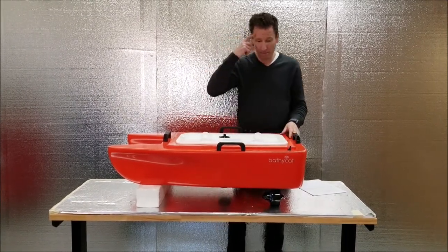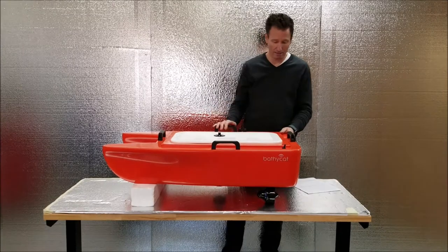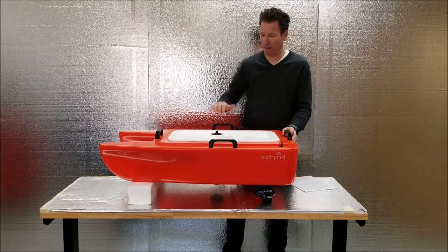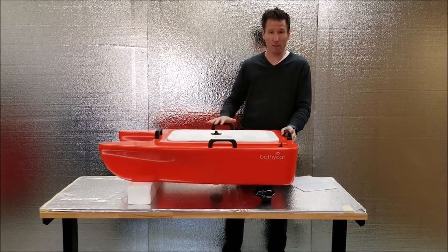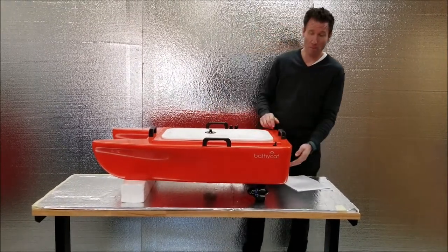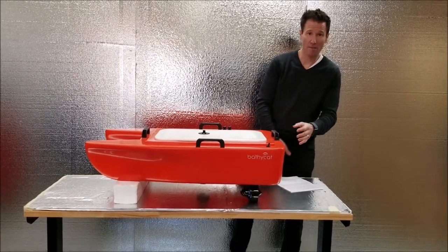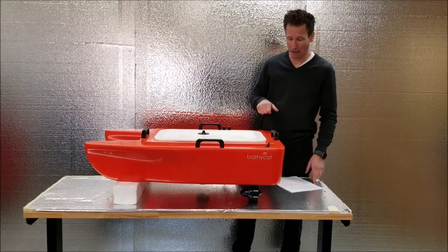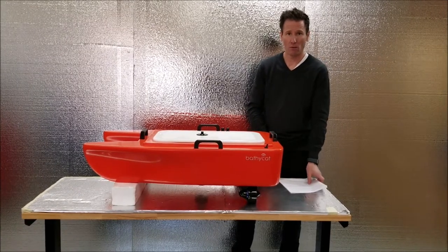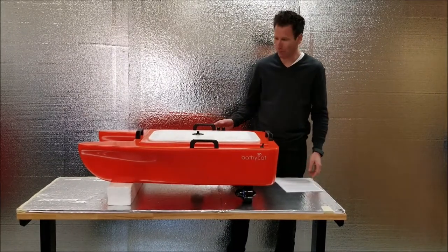On the outside, after use, you could seal the hatch and you can hose it off. Obviously remove any mud or debris that's stuck to the side. If you do use it in salt water, you definitely want to take a little extra care and definitely rinse it well. I like to run the props very slowly and shoot water in on them so it gets all the moving parts. These thrusters are lubricated with water, so you don't want to normally run them dry. Other than that, you could just dry it out and everything should be good to go.